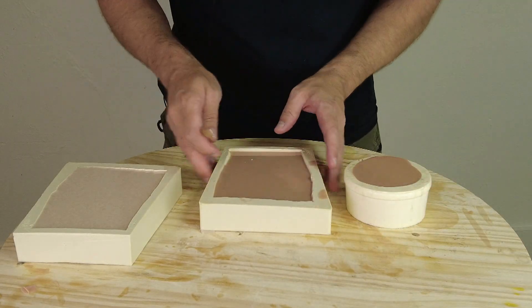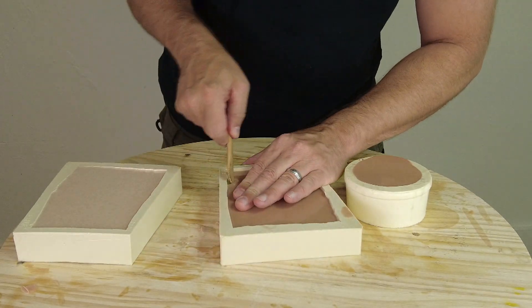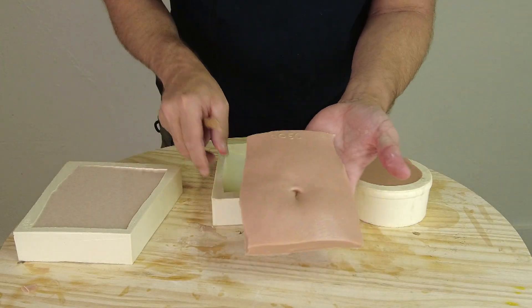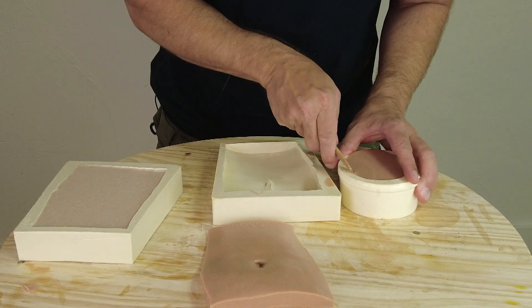It's been about five hours since I cast the original skin chunks, so let's check them out. I'm going to try to get some good close-ups so you can see what that looks like with the flocking and silicone pigment combined. For demolding parts from a resin mold like this, I like to use a blunt tool — like an old wooden sculpting tool — which is excellent for working up an edge and peeling the part out without harming the mold. And there we have our first little belly button cast, and of course our ear.